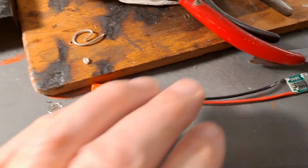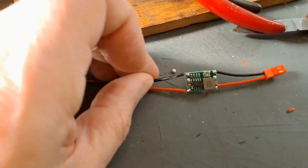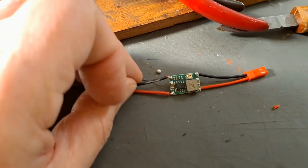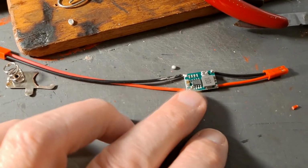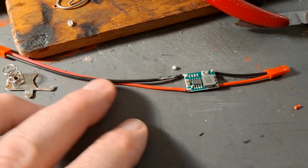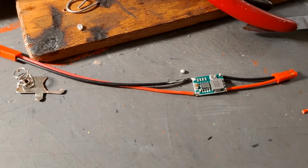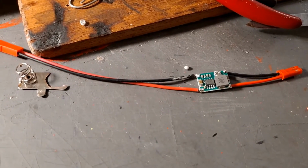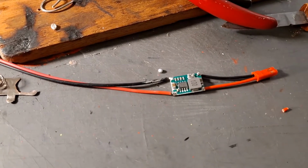But what I'm doing over here somewhere is rigging up this buck converter so it can go in between. So if we want to use it with the 14500 batteries, we can use this to drop the voltage back down to 6 volts. So it's getting a little bit complicated, but that's what we've done.